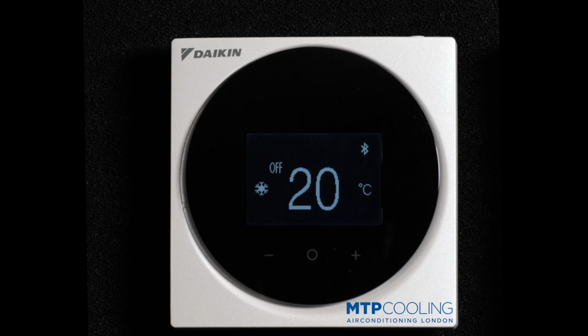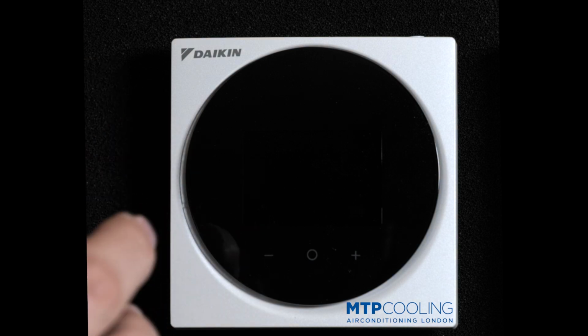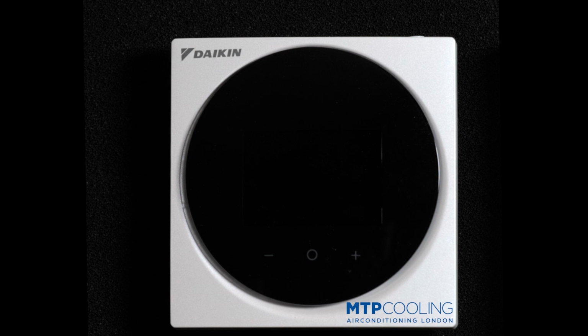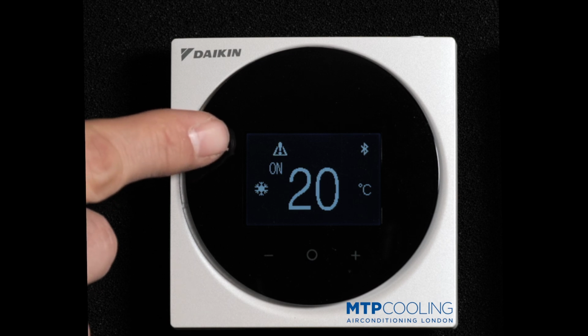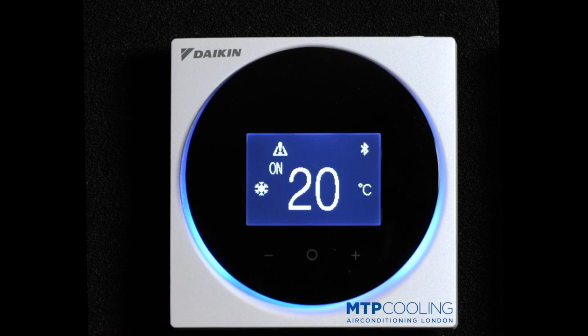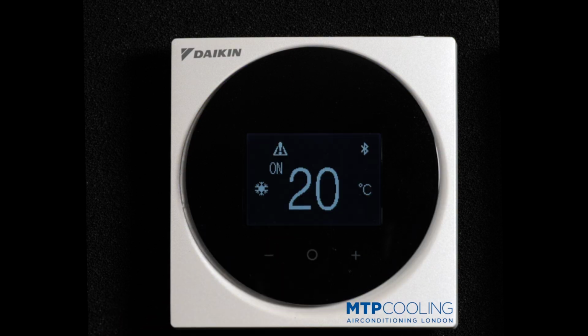Now lastly, I'd like to point out one thing. This controller at the moment for this video is connected to the fan coil unit, where the fan coil unit is not connected to the condenser. That means that it will generate a fault. So if I turn that controller on, you will see an exclamation mark in this corner here, okay? And that is a common concern many users experience. Generally, an exclamation mark signals an issue that needs your attention. However, if it appears shortly after installation, it's most likely a simple reminder to clean the filter.